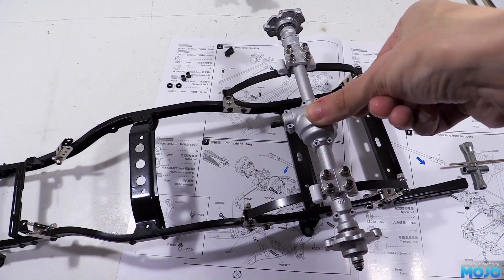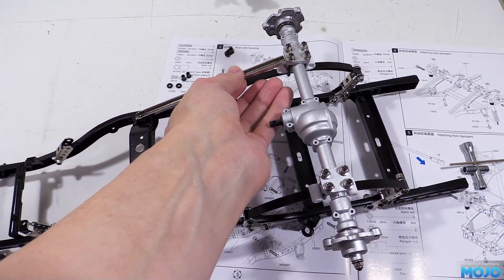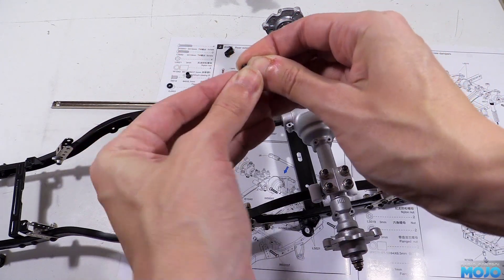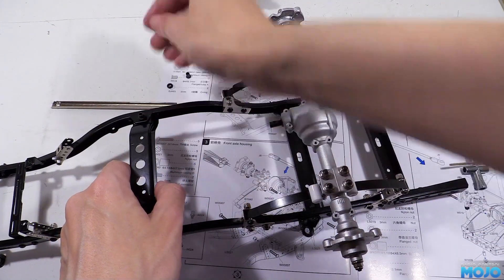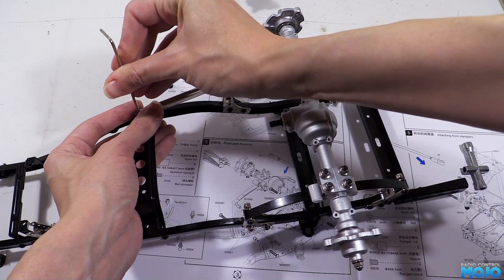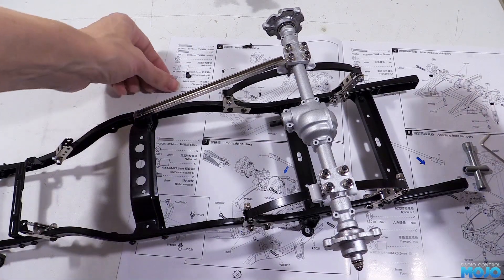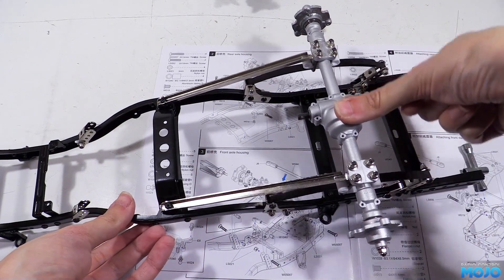If not, back off the nuts just a little bit to gain a bit of clearance. Next, the long bars can go on. On the axle end there's a tongue that just slides in, and the other end has a hole. We need to slide an O-ring over the flanged tube, then the tube goes flanged down towards the chassis over one of the holes in the centre brace, followed by the bar. The hole in the brace is threaded, so all we do is install one of the M3x10s. It's all a bit wobbly and loose, but it does seem to work. I wonder if we could get an O-ring above and below the bar to make it a bit more secure - might be worth a try when we get to the mods. Repeat on the other side, and we've got some working, if rather stiff, rear suspension.